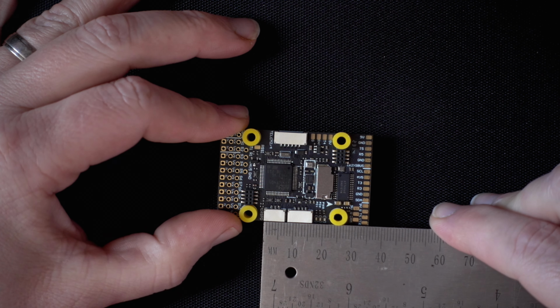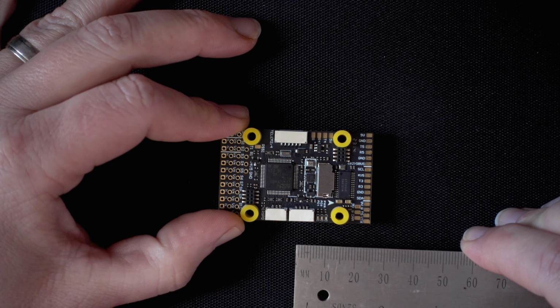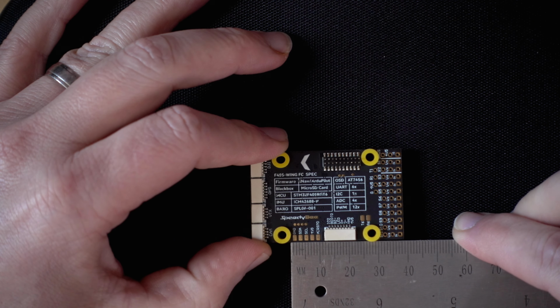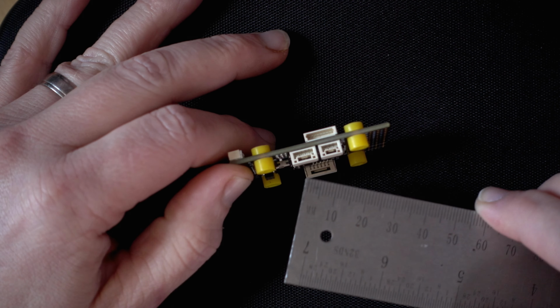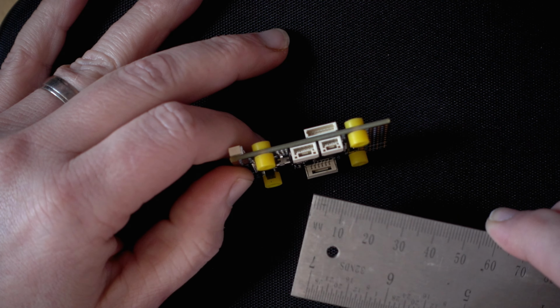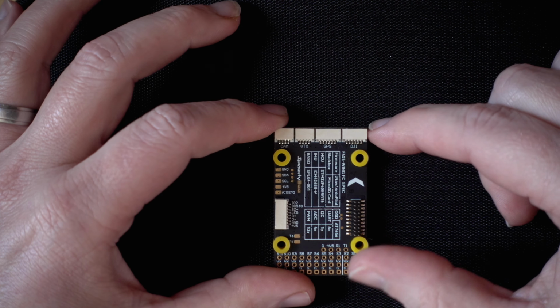We have a space here that is 16 millimeters, 16.5 millimeters, just for these 2 blocks, for something that is already on the board, which takes up less than 10 millimeters. So you can see that, to me, these are just a waste of space. Other things could have been positioned there. You could have potentially had more features. And the same goes for these blocks here.